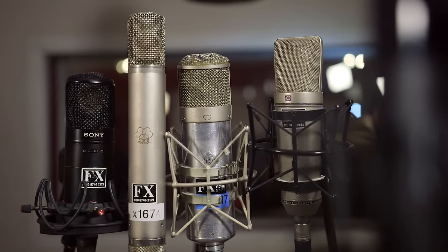The testing methodology is this: we'll have each microphone set up against the VMS mic with the capsules as close together as possible, and go through the range of four microphones, each time repeating the same tests. Those tests are a female vocal with a backing track, a male vocal playing guitar at the same time — where we're listening to spill from the guitar into the microphone — and the reason for that is because although it's relatively easy to model the on-axis response, it's very hard to do that for the off-axis response, which depends on the design of the capsule and housing. The third test is spoken word voiceover, to give a different aspect of the microphones' sound.